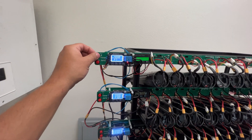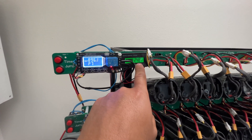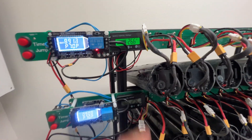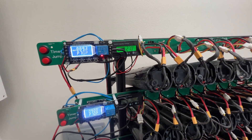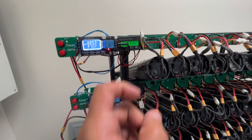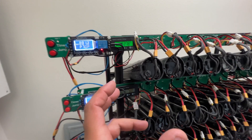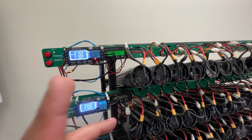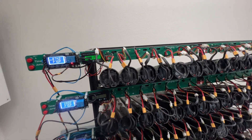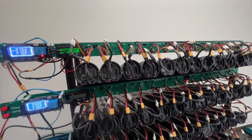Here's how you start the timer — you click here, and then you can see what the charger is putting into the battery packs. These packs are at different voltages and mostly off, which means the MOSFETs in the BMS are off. The packs could be around 30 volts — that's when the BMS shuts off to protect the cells from over-discharge.